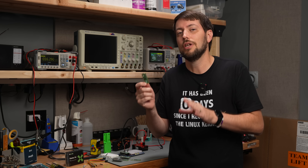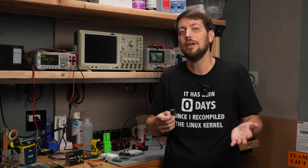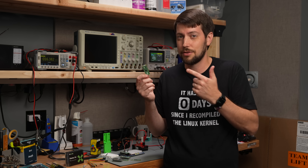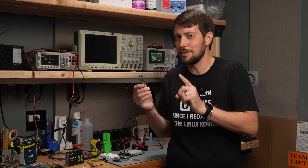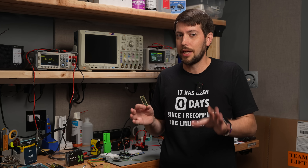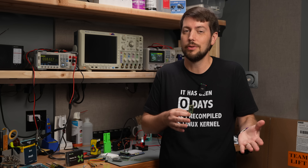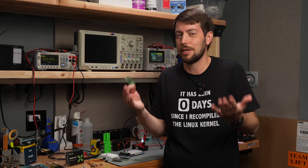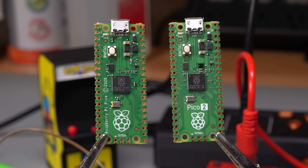The other headline feature is the inclusion of two Hazard 3 RISC-V cores. The ARM cores on here are proprietary — Raspberry Pi pays ARM for the designs. The RISC-V cores aren't really owned by anyone; they're open source, meaning Raspberry Pi can just clone the Git repository and use the designs with no licensing or proprietary specs. That doesn't mean the Hazard 3 cores are faster or more efficient, just that they're open. You can choose between ARM and RISC-V, and even build a universal binary that works on either set. There are a couple caveats: you can't run all four cores at the same time — it's either/or. And there's a lot less code out there that works low-level with RISC-V, so most people will probably stick to the ARM cores. But I have to wonder — is this a signal that people should start transitioning their code to RISC-V?